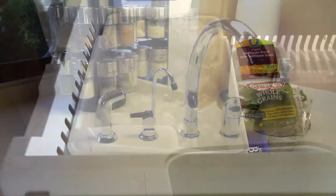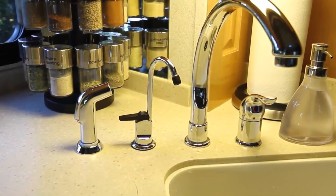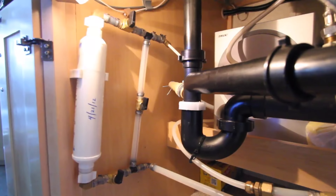If you have a drinking water dispenser at your kitchen sink, it likely has a carbon filter underneath the counter, which we'll want to bypass to avoid running bleach through it. Bypassing the water filter is easy — simply close the two valves that lead into and out of the filter, then open the valve on the bypass line that parallels the filter. This allows water to flow up to the water dispenser without going through the filter.